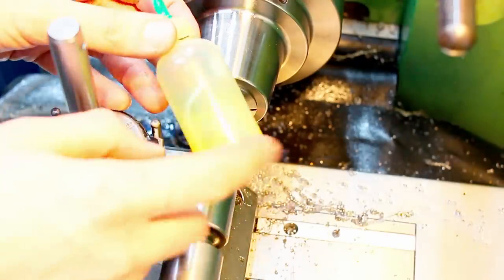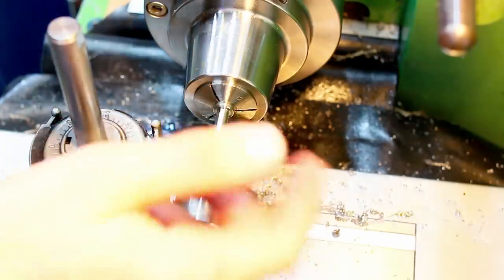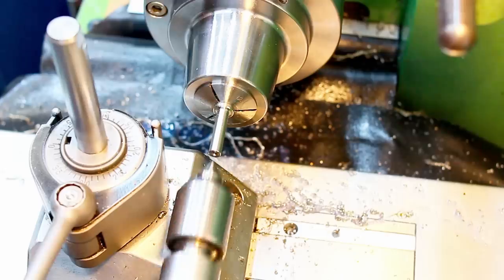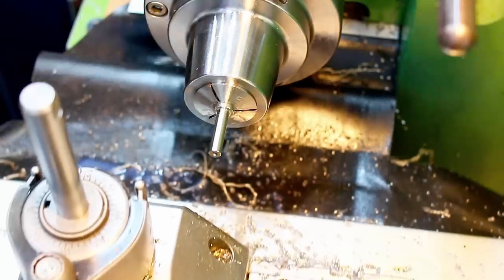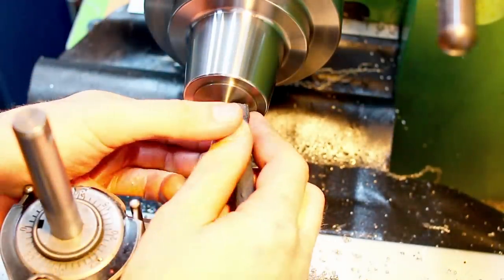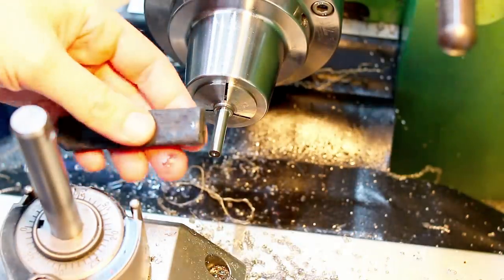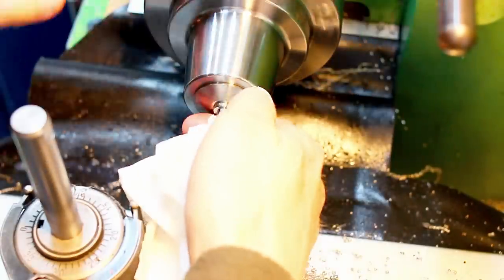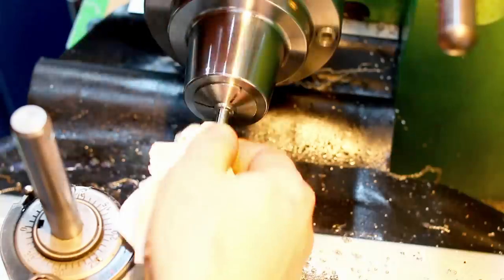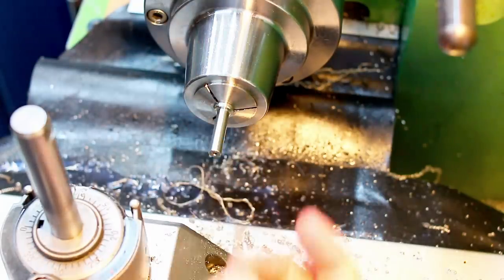Cutting oil, on the other hand, is for heavy forming cuts when you have to use a form tool, a chamfer tool, or a tap. Okay, that's done. Now I can do all the end work: drilling, tapping, and counterboring. This is just a Kratex stick, rubber-bound abrasive, to give the surface a last polish and remove all hairline burrs that might be created by the chamfer tool, for example.